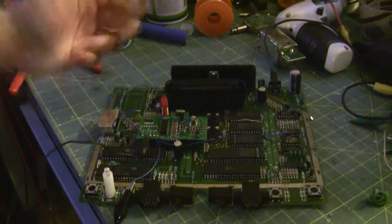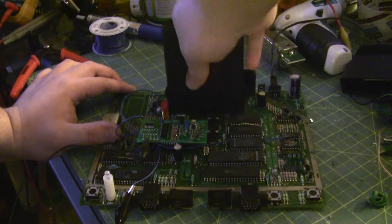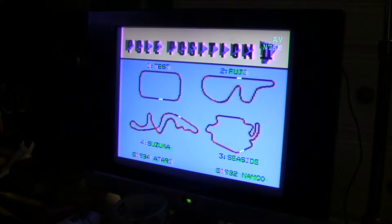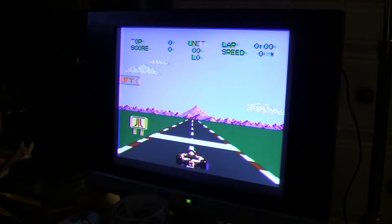So originally, let me just show you what happens. When you have a 7800 game plugged in, here's what I get. Without TN9 connected, the picture looks good. Now, it's actually unfortunately hard to see on camera. But when I reconnect TN9, notice the flickering on the TV. These are actually vertical bars that are scrolling up.